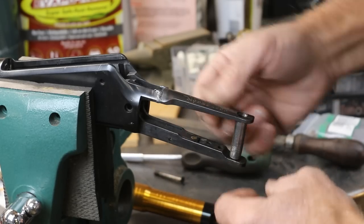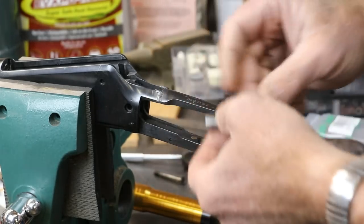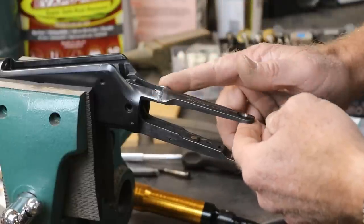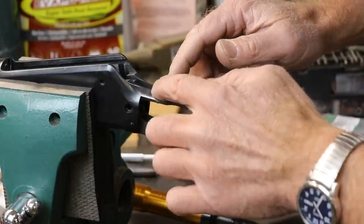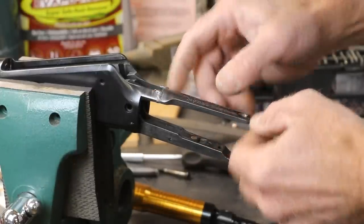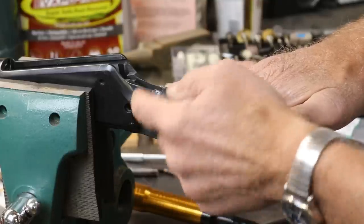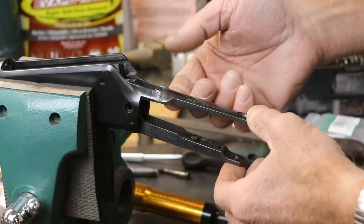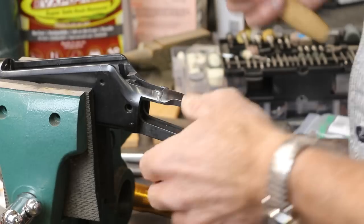Okay, so we didn't spring up. Oh, and it slides right out, just about the same pressure we had when we put it in. So we really got fortunate there, because when you've got all this heat going on up here, it's really easy to introduce stress. But because we welded the thicker, heavier welds on top first, and it wasn't able to spring up this way, we probably introduced some stress that way, and then the lighter welds on the bottom probably pulled back down, and we just were fortunate to get it just right, so it's not in a bind in any way.